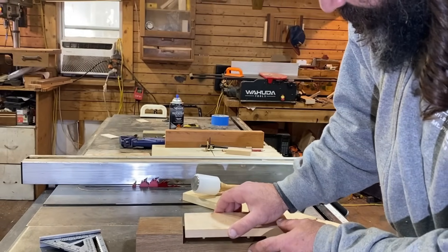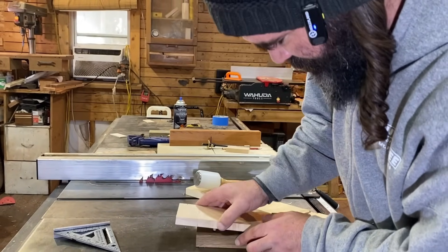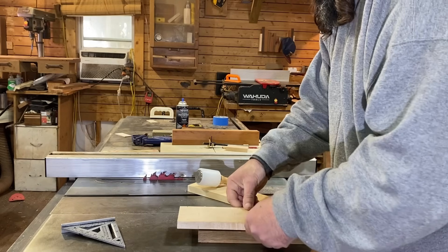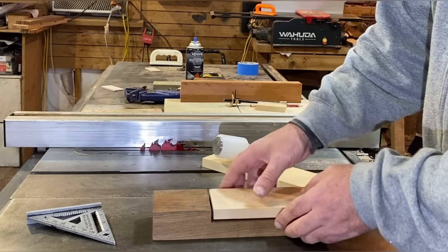There we have our holes. I'm going to cut four dowels at seven eighths of an inch long and give them a nice cap. We're going to transfer these the same way we did for our last key ring holder — just take our Sharpie and give it a nice heavy covering right on top of the dowels. Once that's done, put a backer right here to keep my back flush with the spacer in there to keep me at my eighth inch. Set it right on top, give it a nice press and a little wiggle — and there you have where your holes go. Let's head back to the drill press and get our base drilled out. If we laid everything out right, it should just slip right in. Oh my gosh, that was so smooth — that worked out really damn good.